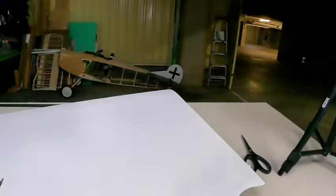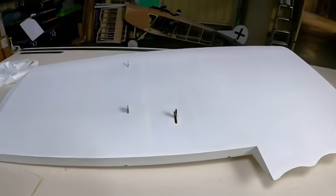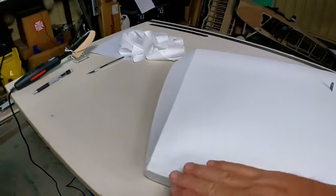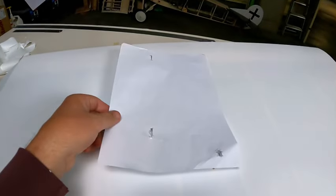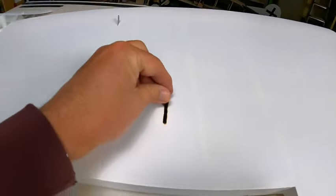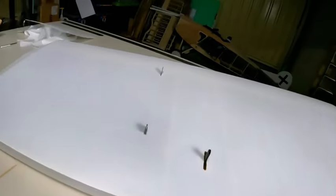It's much, much easier covering the lower section of the wing, the underneath, because it's generally a flat profile. You might have seen me at the start of the time lapse messing around with a little template. It made it easier on the fabric to find these penetration marks for the end strut holders, and also the servo arm sticking through the covering.